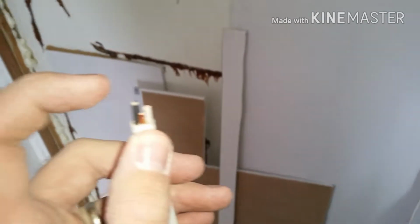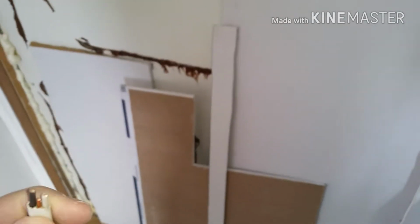But what I'm going to do instead is I'm going to use one of these. I'm just going to cut this open. I'm trying to do it for 2 different places. I'm going to have 2 three-way switches going on. So a total of 4 switches going to 2 different lights. So I'm going to have one here, going to this light, a switch here, I have another switch here that's going to go to a light over the sink here. It's going to go up there, and I want another switch right here next to my garbage disposal switch.